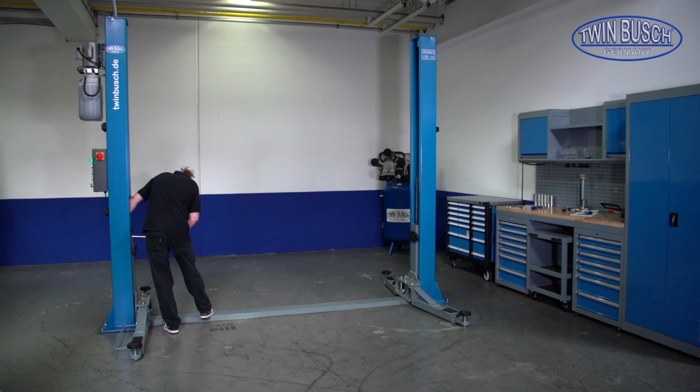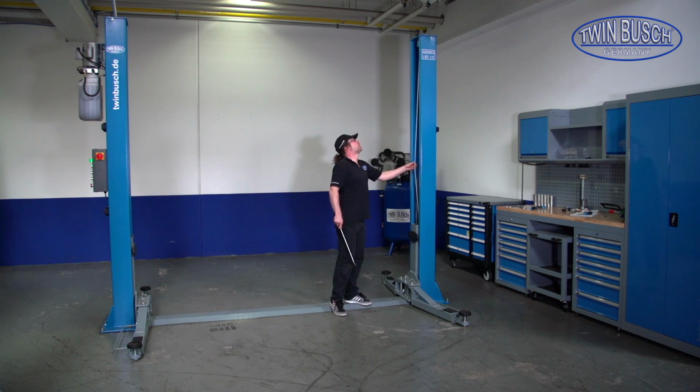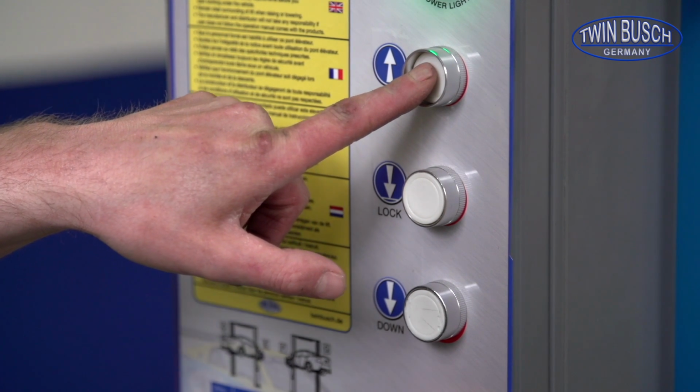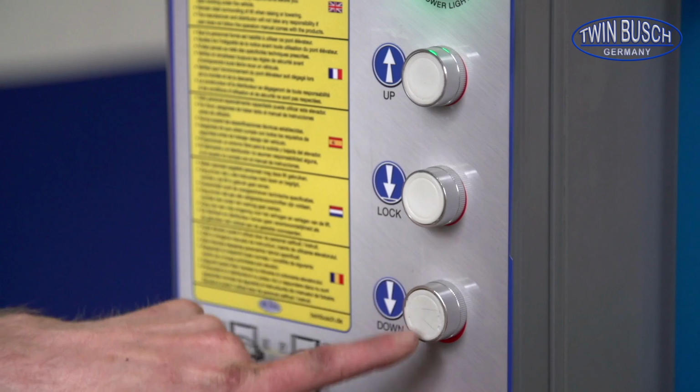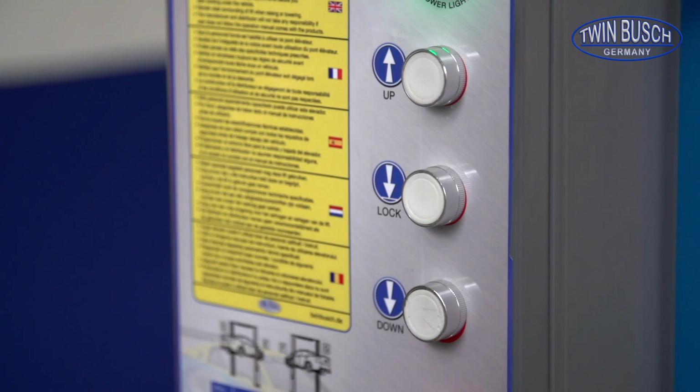Since the leveling cables are connected to one another, tensioning the main side now automatically leads to tensioning on the opposite side. Raise your lift upwards and pay attention to the clacking sound of the safety locks. The side with the hydraulic pump should click first, then the opposite side. The reason for this is that the main side has the shortest path to the hydraulic unit. The opposite side is forced to be synchronized by the steel cables.